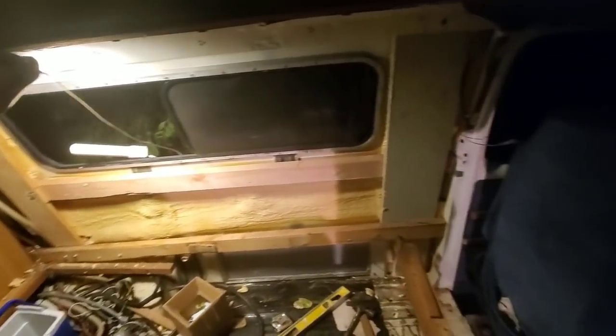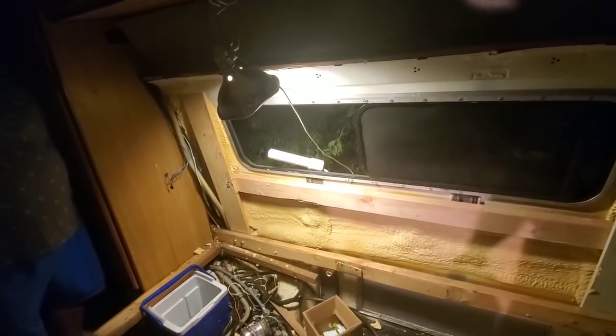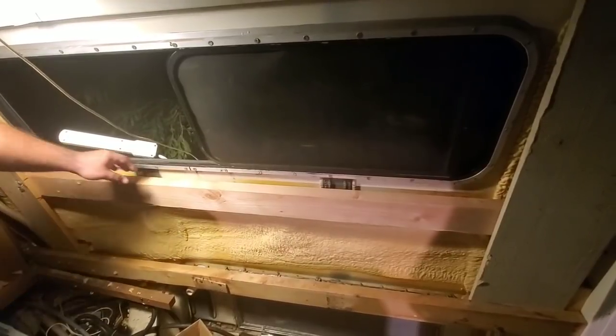Our idea was to build basically a frame here, extremely strong, that would do two things: make a good surface for the finished panel to go on and accommodate the frame that has to be reattached on here. It had to be strong and engineered so that everything will fit back on the windows. You can see this is all wedged in here at the top and it sits on the base down there. I think it's going to be excellent when the wall panel is put in here. You can demonstrate, Marshall, how strong that is to support a backer for a kitchen table. There are four of these — they're standard zinc hex screws. I had to counter-sink them because we're going to be putting paneling back over this, with nuts on behind there to hold them.